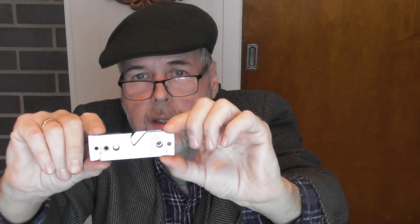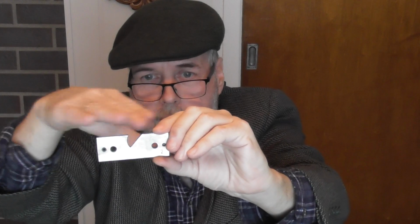So I made more of these replaceable jaws for my machine vise. So the one I showed you has got number 1 on it. That's what I start out with, and so they get this shape. And then I put these in there to level it off like that. And then it fits in here, and I can level it off that side. And finally there's one more, and when I'm done with that, this is the shape that I have.